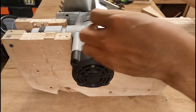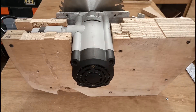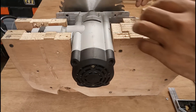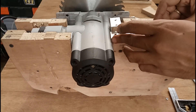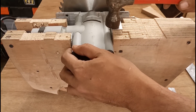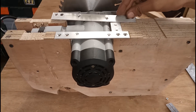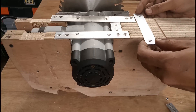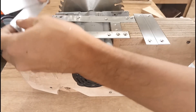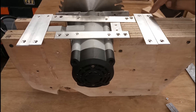Then I'll check and make sure that the blade is parallel with the carriage — this is critical, so take your time when attaching them. I inserted some aluminum shims at strategic points, not shown here, but I'm constantly checking the parallelness and squareness of the parts every time I drive any screw or shim, making sure nothing is moving side to side. Then I secure it with flat aluminum plates — don't forget to make the rabbets on top of the carriage to make them flush. This aluminum will serve as the bridge that holds the carriage housing together.